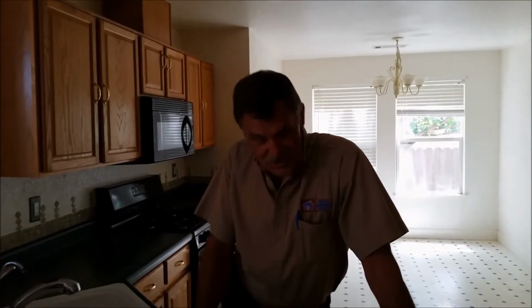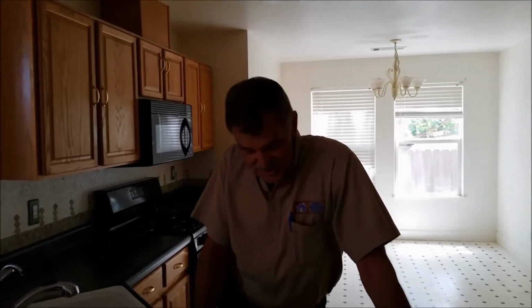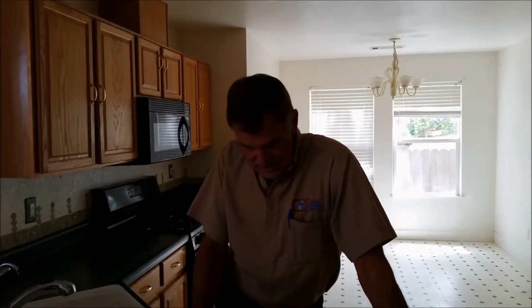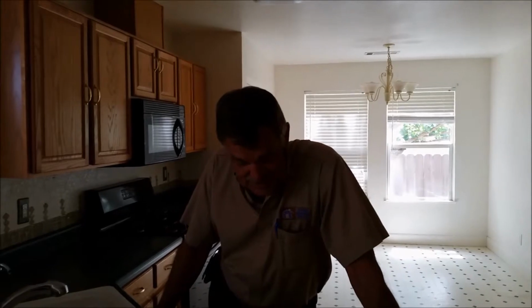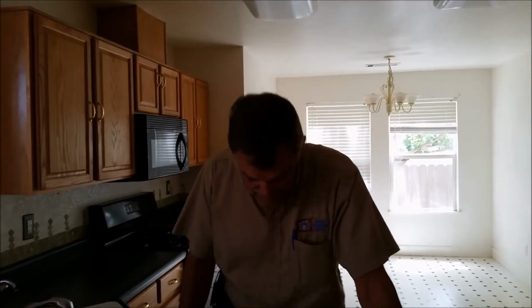You know, pretty nice house overall. Starting with the outside of the house, just a little bit dusty, a little webby outside, but the stucco was in good shape overall. I saw a little bit of driveway deterioration out there. It could have been salted at one time, so we have a little bit of flaking on the top coat of the concrete, but as far as any cracking or lifting of the cement, it doesn't have that. That looks in good shape. I'd recommend clearing the grass and weeds away from the front part of the stucco out here in the front entranceway. It's up against the stucco, so you want to clear that away.